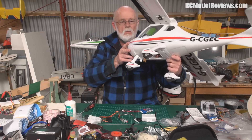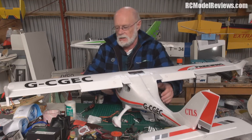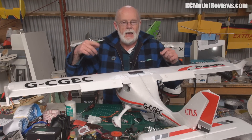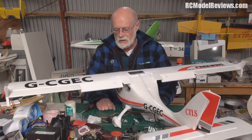I managed to do it, so it's all wired up and great. Those leads come down and go onto the receiver. On the Taranis it's a piece of cake to set up the mix - I've got the two servos running off the one slider, with one servo operating in one direction and the other in the opposite direction so the flaps move in unison. That was actually the easiest bit.